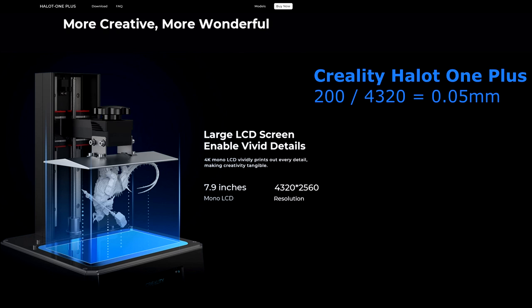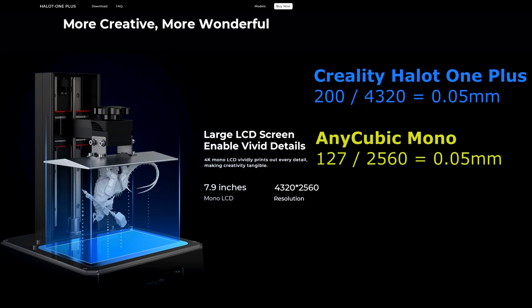It's actually fairly similar to my existing 3D printer which has a resolution of 2K, 2,500 pixels, but also has a much smaller build plate of 127 millimeters — which, divided by the 2K resolution, also gives us 0.05 millimeters or 50 microns. So often we see phrases like 4K or 8K and think they must automatically be better. In this case the 4K doesn't give us significantly higher quality, but it does enable us to maintain that same quality over a larger build plate. And during the making of this video I did find that bigger build plate very helpful indeed.